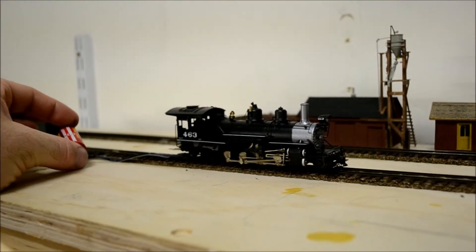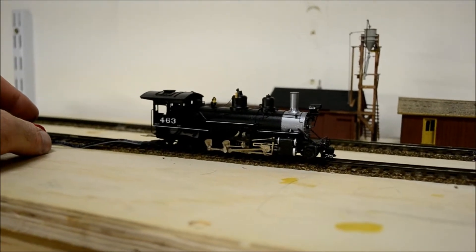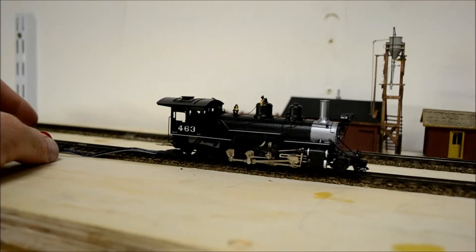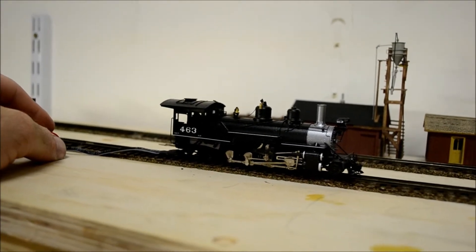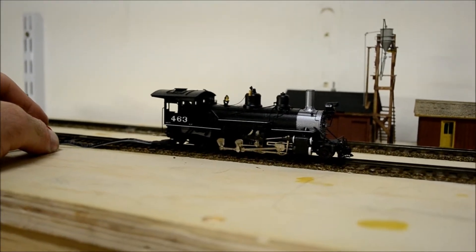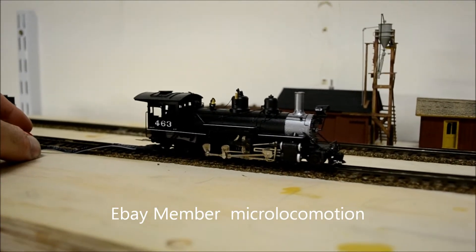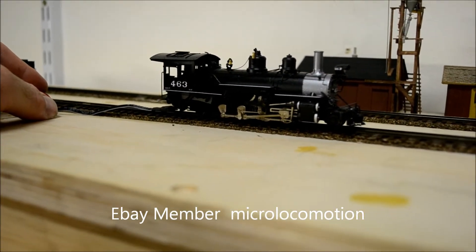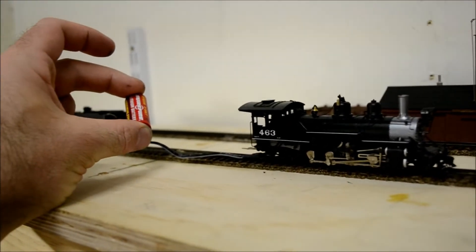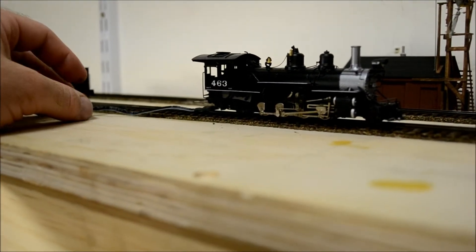I've just given an update on my Westside Models K27 that I painted and just got the motor for last night. It's a Maxon 7-pole coreless motor, 16 by 29 millimeter, with an internal flywheel. I bought it from Locomotion on eBay, and I just have it rigged up with a battery right now because I don't have my decoder, so I'm just testing it to see how everything goes together, and so far it's been running good.